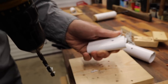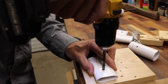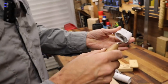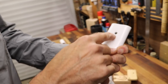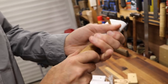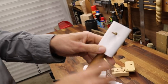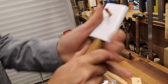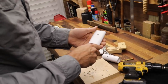I'm going to go through the front and then through the back as well, since we're going to open this up. When we put the knife back in, the hook should just be visible in the hole, so as the peg goes in it actually pulls the knife in that bit further. This is a roll peg and it's quite thin — it's baggy in the hole at the back — so we're going to make a slightly bigger peg.